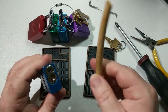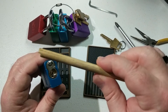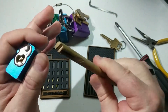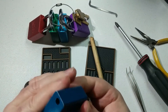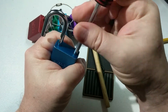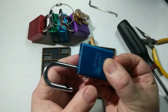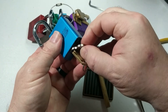Let's take one of these apart. The only thing I need is this homemade plug follower — the measurement is 0.385 inches; I made it from a 3/8-inch dowel and cut one little notch out of it, basically half of that little circle, to fit on the back of the plug. So let's go ahead and unlock it. This screw will sometimes be a little tight on the first go around because it's got some blue Loctite on it. We'll dump that out — you can see where there was some blue Loctite on there. Then we'll grab this retaining cap and you'll see the plate comes right out.